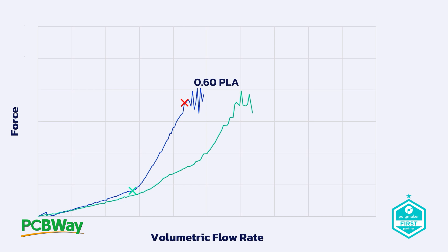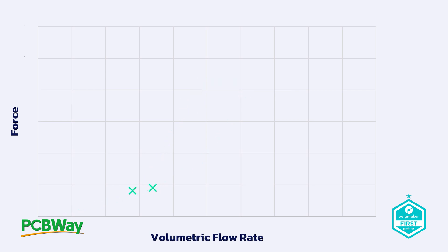If we then plot another curve for a standard 0.8mm brass Revo nozzle, the maximum usable flow rate is higher than with the 0.6mm nozzle, as expected. Focusing in on these points of maximum usable flow rate, we can begin to create a cloud of data for the extrusion force requirements. Taking this approach for a range of setups, we generate a cloud of data points containing the extrusion requirements for various hotend, nozzle, and material combinations. We can now use this cloud to establish force requirements for an extruder to ensure it will not be the limiting factor in a system.